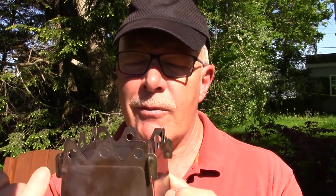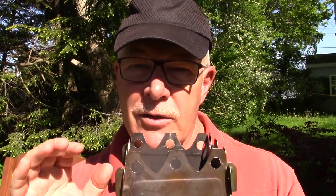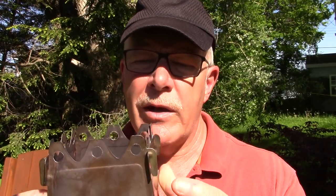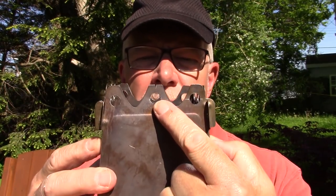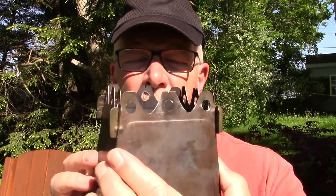So what did I do? I do have a drill press at home, though I'm sure this could be done with a hand drill. I did need to use a carbide drill bit. I started by punching center divots in each plate so the drill wouldn't wander, then started with a smaller diameter drill and worked my way up to 3/8 inch. Those are 3/8 inch holes. You could probably go a little larger, but that's the largest carbide bit I had.